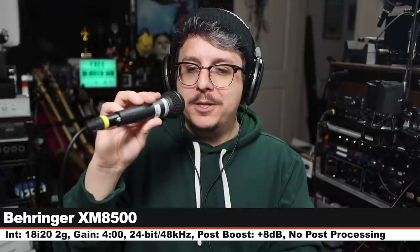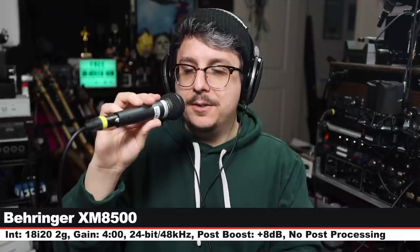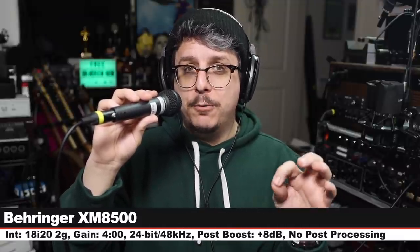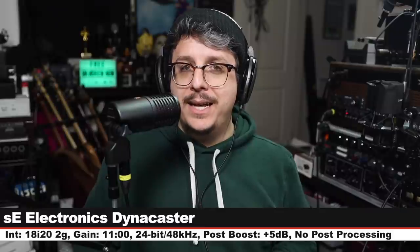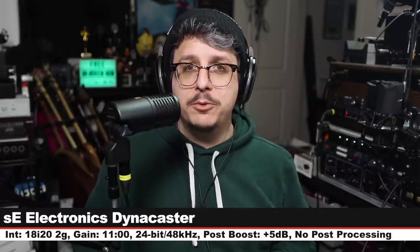Now we are on the Behringer XM8500. This goes for about $25. I am 3 inches off, 48 volts is off, my gain is set at around 4 o'clock on the 18i20, and here is how it sounds. Let's do more comparisons. Back again, and here is how the Dynacaster sounds. Nothing has changed. Let's jump to another mic.